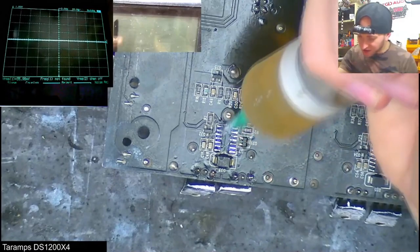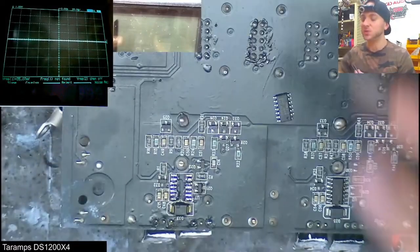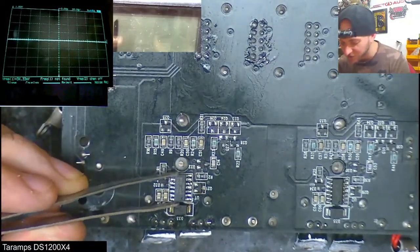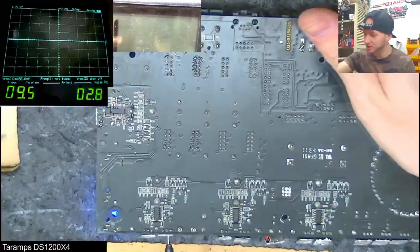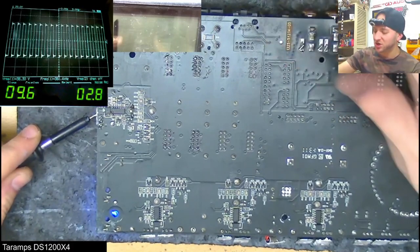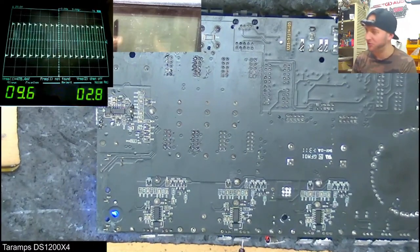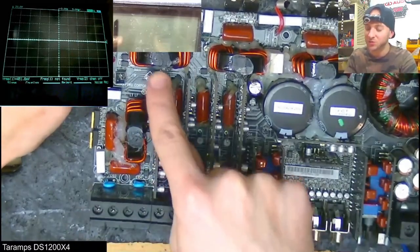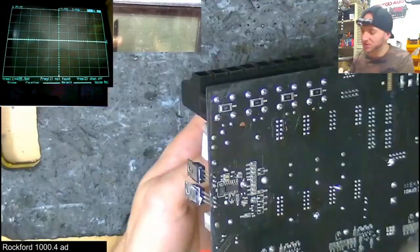This wasn't the case if I'd have thought about it properly, but in my mental state I was like, maybe this is the issue. So after waiting a long time for a sketchy and possibly fake replacement drive chip from AliExpress to arrive — because these are no longer available anywhere apart from China — I fitted this new chip to the channel that now had the bad daughter board on it. With the new drive chip fitted, the problem was still the same, of course. At this point I had reminded myself that I knew for sure there was an actual component problem on the daughter board itself. I removed both the bad daughter board and one of the good daughter boards and did some more comparing, not really finding anything different on the multimeter.